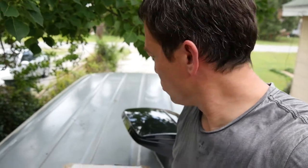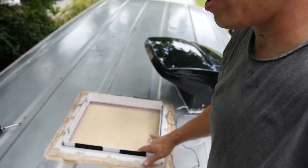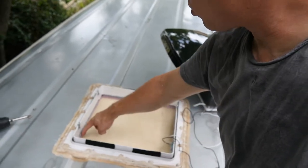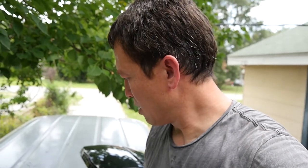I was measuring out the hole I need to cut for the exhaust fan for the wood paneling — the Luan — and then I was like, you know what, I don't need to measure this. All I need to do is remove the fan, prop up the Luan where it needs to be, and then trace around it. That makes much more sense that way.